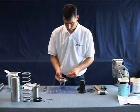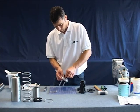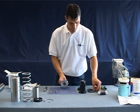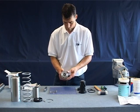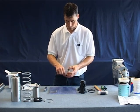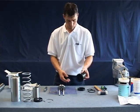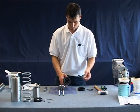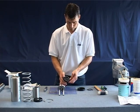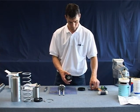First install the o-ring between the guide bearings and the larger o-ring on the outside of the cylinder. Next mount the outside o-ring on the lower piston first and then the two o-rings that seal towards the sleeve.